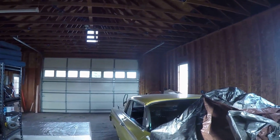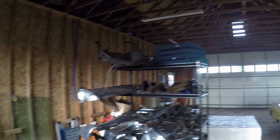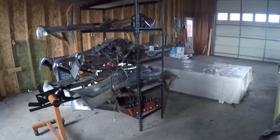So I'm obviously going to insulate it. The walls are 2x4 framing, so I'm going to be limited to just R13 batt insulation in the walls, and I'll get the faced insulation so it has the moisture barrier. And I'm going to do blown-in insulation above the ceiling once that sheetrock goes in, which should be pretty soon. I'm probably going to do that to about an R30.